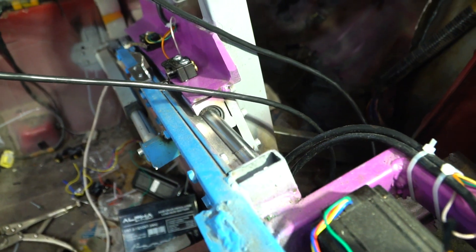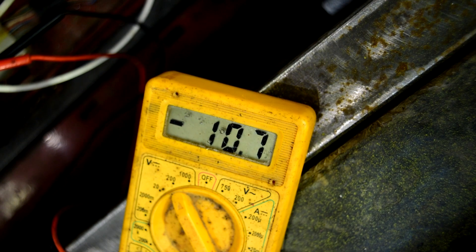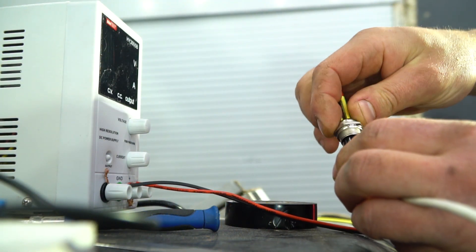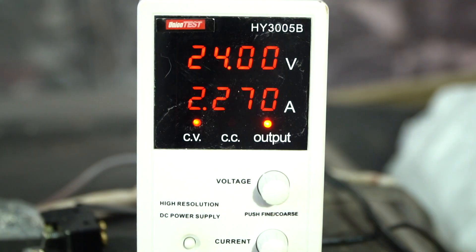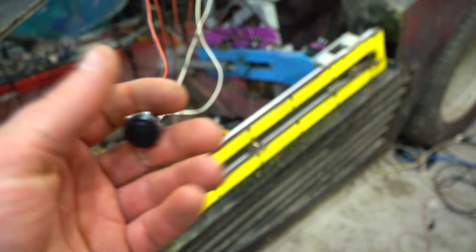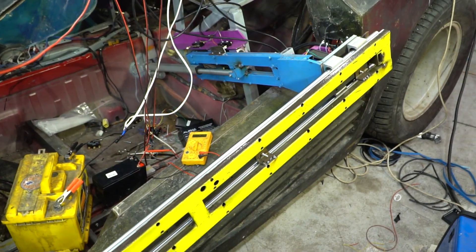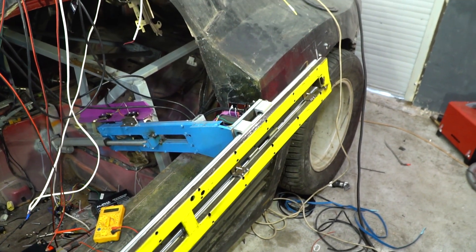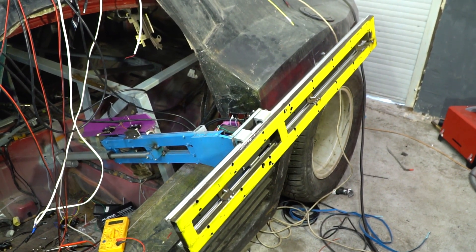Something went wrong — one power converter didn't work for some reason. It gave out only 10 volts instead of the prescribed 24. I thought it couldn't handle the linear drive, so I measured the actuator's consumption on the laboratory power supply — it was only 2 ampere, which is 4 times less than the converter power. I connected another converter and everything started working as it should. The problem consisted in a defective platform. The neat electronics placement turned out for the best — everything works more than stably.